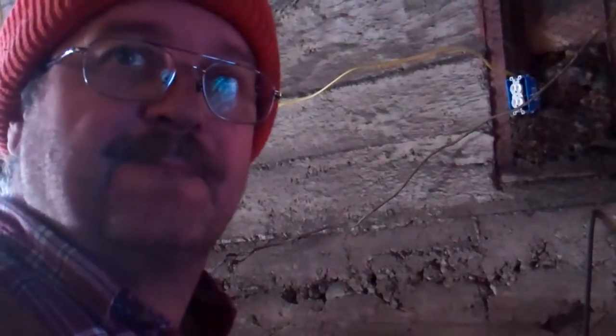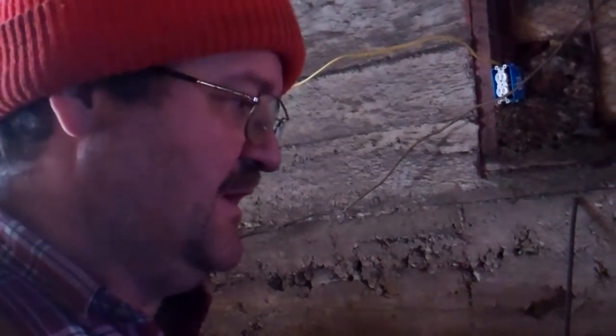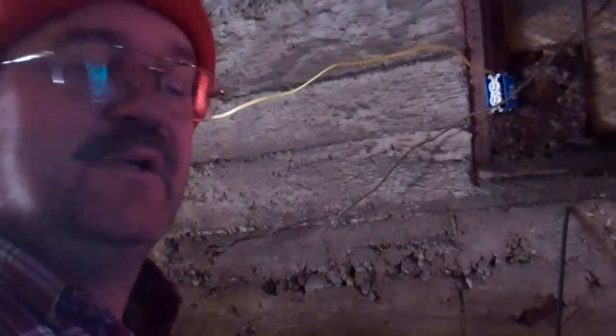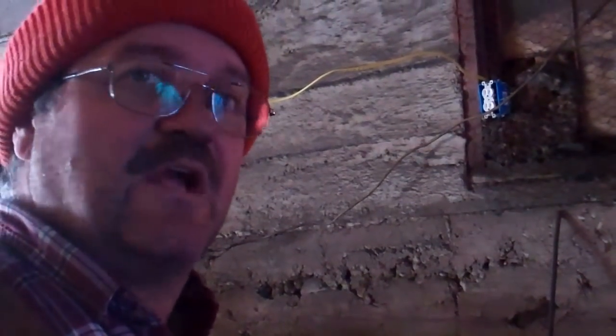How do you take the look, though? With that kind of stuff, I'll just look at how it breaks. Whether it snaps or bends before it breaks, that gives you an idea. You can also look at the sheen of it, because at that point, it hasn't really been folded at all. And if I'm really curious, I'll fold the whole thing a few times, take a sample, throw it in my metallurgical microscope, and then I can tell exactly where it's gone.